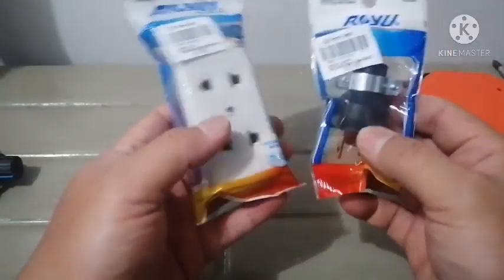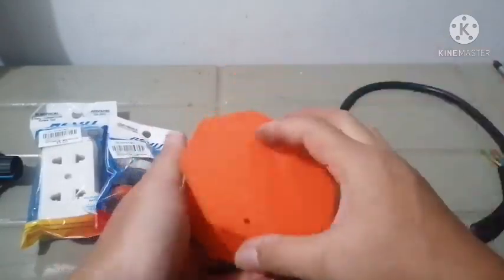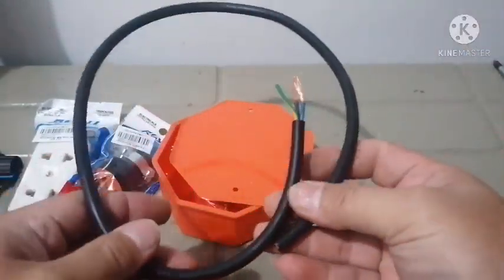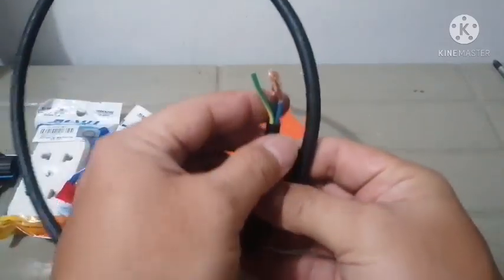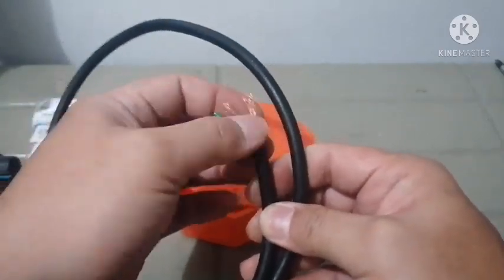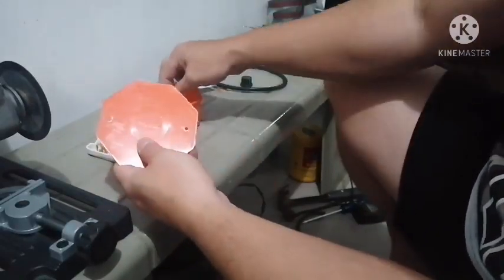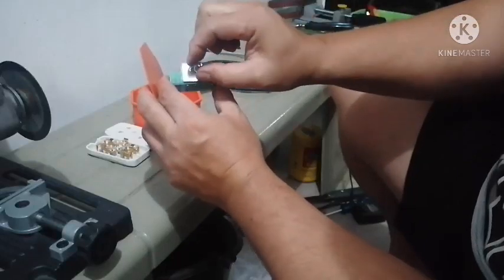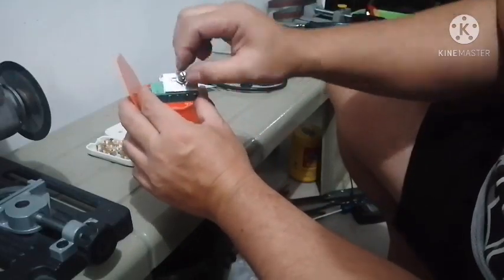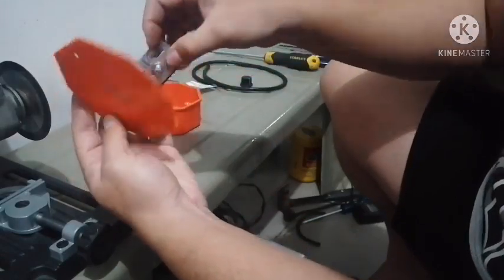The common items you can buy from any hardware store: an extension outlet plug, a junction box with cover and screws, and spare wire. The wire should be at least standard size that can handle power from 220 volts. The first step is to drill holes in your cover so that you can attach the device. Remove the knob — you can easily just pull it out — and then drill the holes.